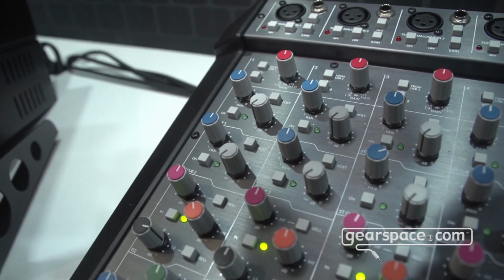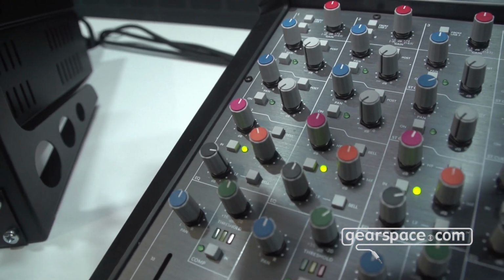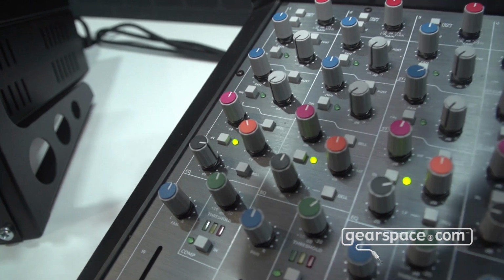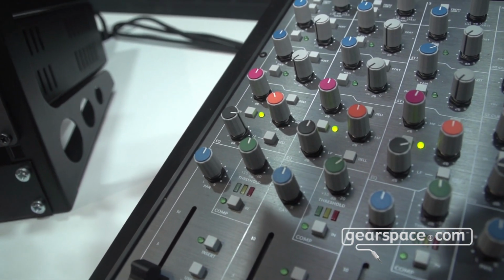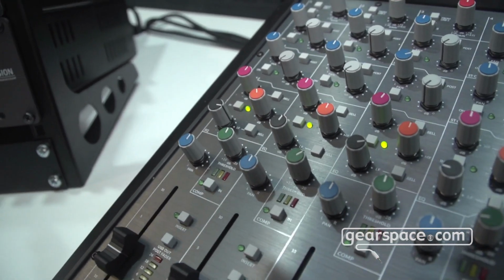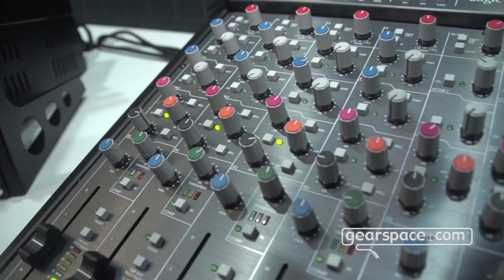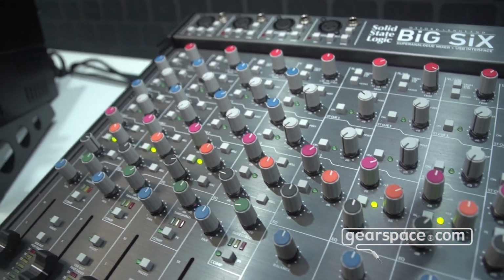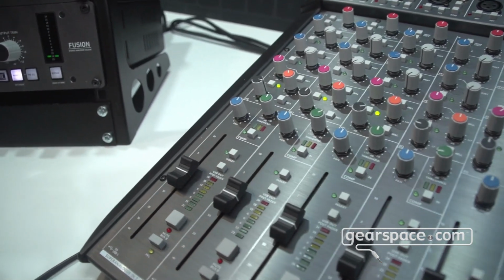We've got a 3-band essential version of our classic E-Series EQ, dedicated high, mid and low bands with bell or shelf curves on the high and lows. And then just below that, we've got the classic SSL channel compression. So synonymous with our 4000, 9000, AWS duality. It's program dependent attack and release with auto makeup gain, so it's great for smoothing, nibbling and just generally controlling dynamics before it goes into the mix down stage.